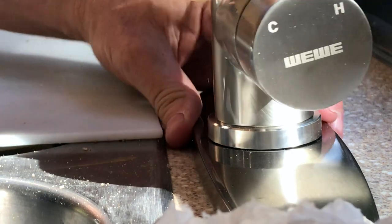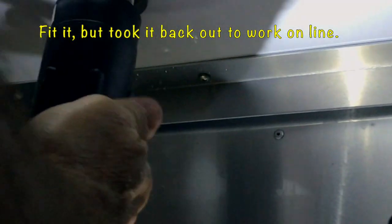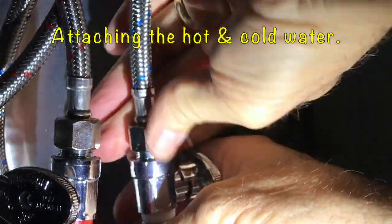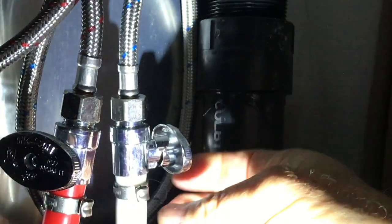I'm going to have to mount it just like that. This right here like that - this turns, so there we go. This is so nice compared to the old stuff. The trick is not to over-tighten and compress the seal in there. You want them snug, but not too tight. This is where not being a bull in a china closet makes a difference.